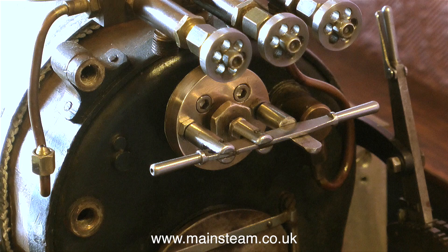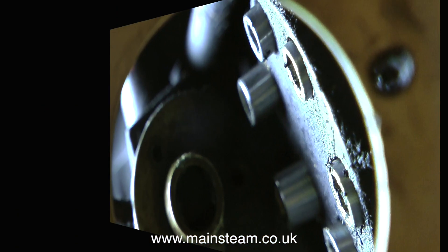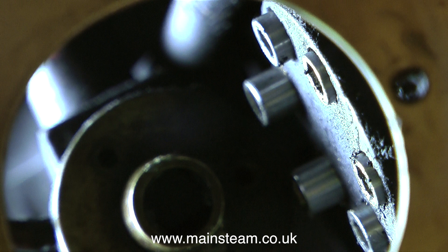This clip shows four of the bolts — although you can only see two of them — holding the gland assembly which also supports the regulator onto the boiler back head. And here's a view of the wet header, taken through the hole where the chimney sits. All of these bolt heads are machined to exactly the same size, but the top two go nearly all the way in, the next two stick out a bit, and the bottom two stick out fully. It would suggest that all of the holes in the wet header are not counterbored to the same depth. This is not a problem at all though — the main thing is the bolts are never going to rust in place.